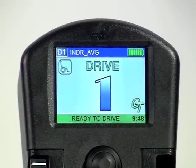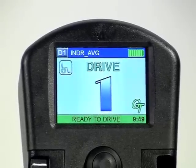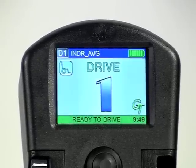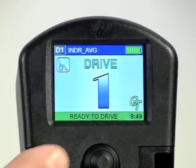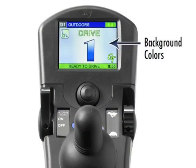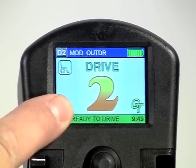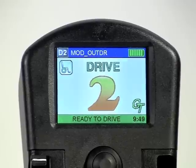Last but not least is the color LCD screen. The use of color on this display does much more than simply provide aesthetics — color is employed to the driver's advantage, making the screen simple to read and easily noting drive profile, mode, and even status. Drive profiles are easily identified with large colorful numbers. Users unable to recognize the numbers may be able to identify the active drive simply by the color of the number. Background colors are also separately programmable for each drive in the performance adjustment menu, with six options to choose from, so each drive can have a different background.